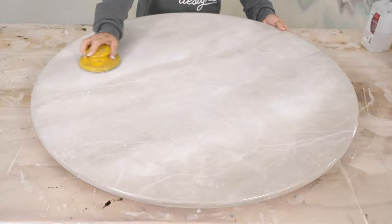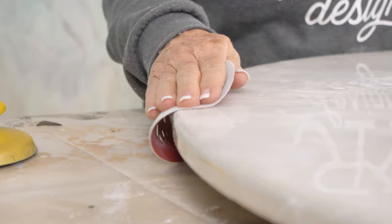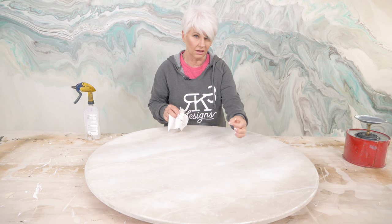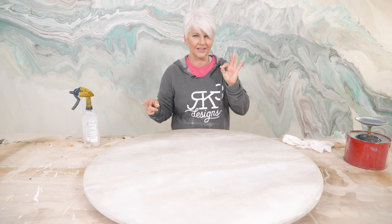I've done the surface, now I'm going to take the sandpaper off and do my edges. Once we've sanded, we're going to come back, wipe all the dust, making sure to get that sanding dust out of those crevices. Once you've cleaned the surface, be very mindful not to touch it with your bare hands because of the oils on your fingers. I'm going to mix up another clear coat — we'll apply it at three ounces per square foot. That'll be our final flood coat and we'll be done.